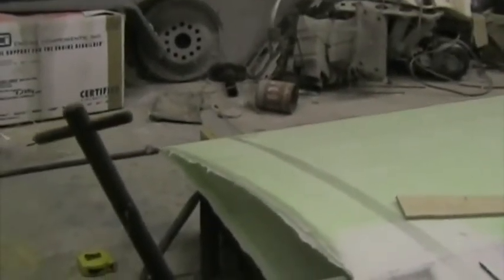And there you can see the little red laser dot that's projected down to the leading edge at the tip. And if you drop a tape measure from the red dot here, it should be 333mm down to the leading edge here to indicate that we've got the right dihedral, which is 3.7 degrees. More importantly at this stage, we've got a straight edge under the wing. As per the manual, it's touching the trailing edge underneath and it's resting against the bottom of the spar.